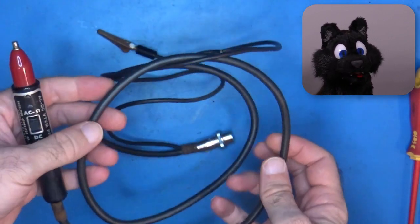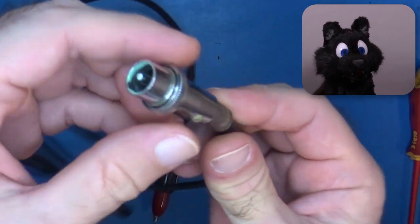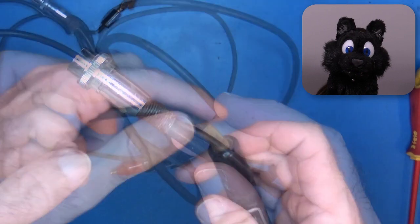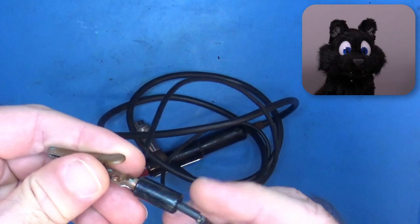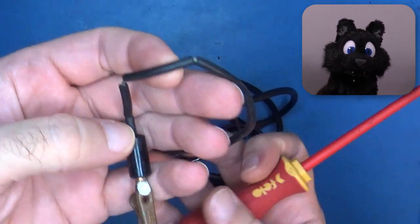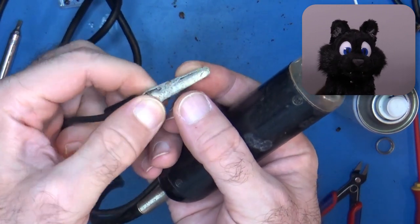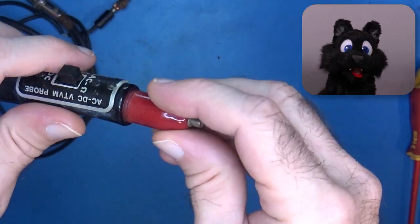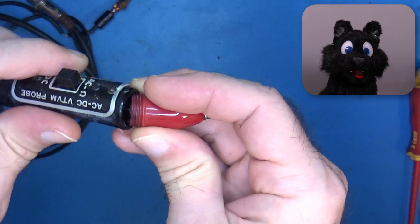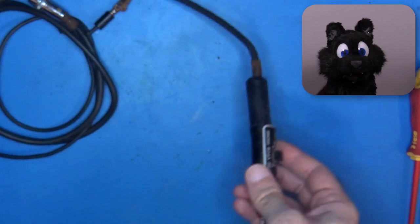The probes are another source of grief and indicate even more moisture exposure. The plugs are nice and shiny, while the springs that protect the cable are rusted almost through. Yuck! The cables are also way too stiff and the insulation is breaking off. Oh, and the alligator clips? Completely rusted. Tips? Nope again. The standard one is broken off and the HF one is missing altogether. From all the components, the probes are in the worst condition, so let's start by taking care of them, shall we?